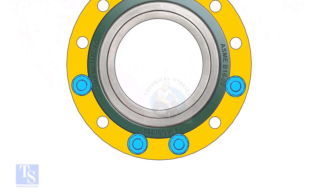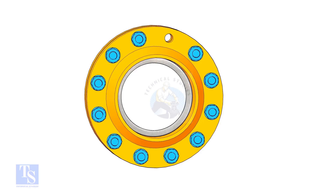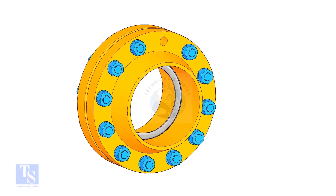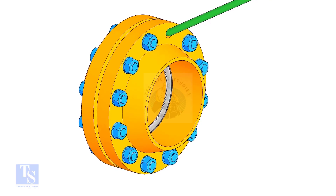Put the remaining bolts as per the shown sequence. Use a lever bar to align the holes and the outer face of the flanges. Now lift the gasket to its position — you can use a piece of a welding rod.